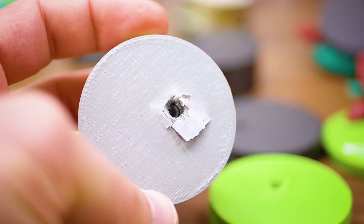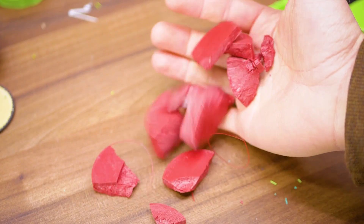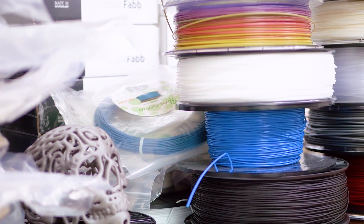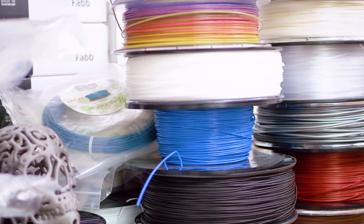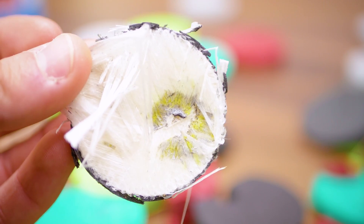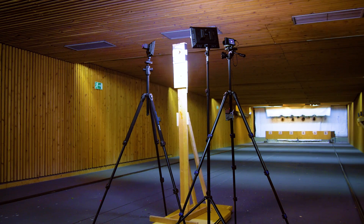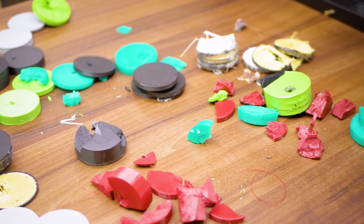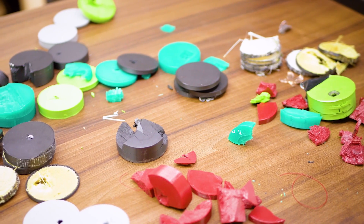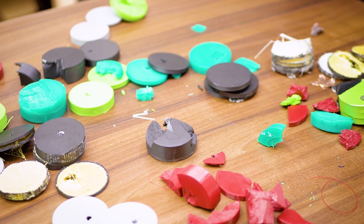While I usually recommend 3D printing with PETG instead of ABS for most things, I think we might have found the weak spot of PETG. Whereas the ABS part now has a .22 caliber bullet solidly embedded inside it, the PETG just completely shattered after stopping the bullet. One thing to keep in mind is that not all materials are made the same, so filament from one manufacturer might behave completely differently to one from another supplier. There are most certainly ABS materials out there that are much weaker than this one, and possibly PETG and co-polyesters that don't shatter as easily. Thanks to Markforged for making this video possible — if you enjoyed it, give it a thumbs up, share it, get subscribed, check out the affiliate links in the description, or join over on Patreon for monthly hangouts and more.